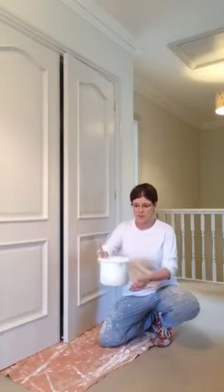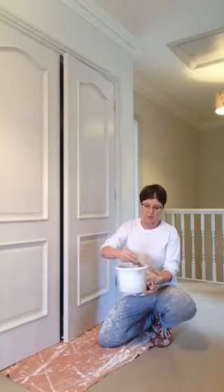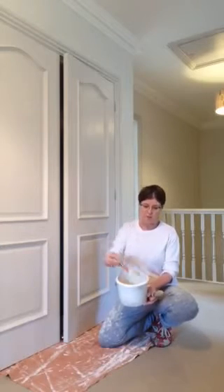How to paint the door. First of all, use decent brushes and work from a paint kettle - don't work from the tin. The kettle is about one-third full so when you dip your brush in and load it up, load it up well since we've been working with it for a while, so it's not sparse on the first stroke. Dip it in, dab-dab on the sides, and that's exactly the right amount of paint you need.